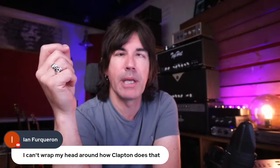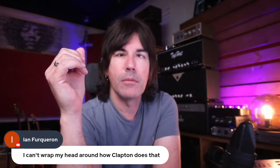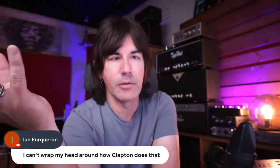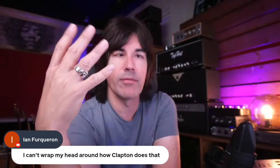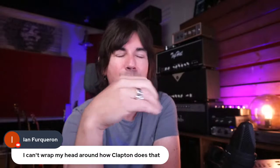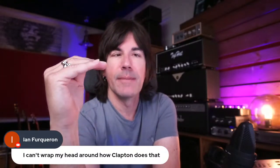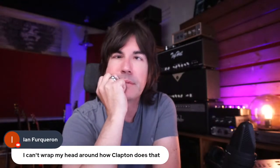When you have master volume amps, preamp gain, or pedals, they're developing their distortion in a certain way. But what happens with the old Marshalls, like the SV would, I think, because it's basically just an old Marshall circuit, is that compression where the chord or note evolves after you hit it, and goes meow, right? Whereas a pedal or a preamp gain based amp just kind of goes ah. In other words, there's this linear quality to the overdrive and the way the chord fades that doesn't really change. Whereas with the old amp, it does this thing, and there's no getting around it.